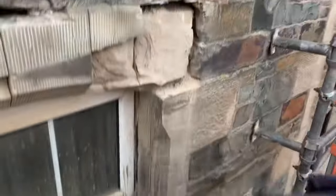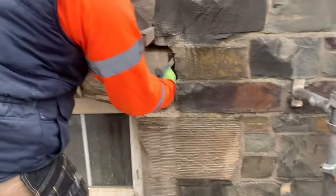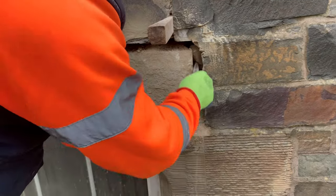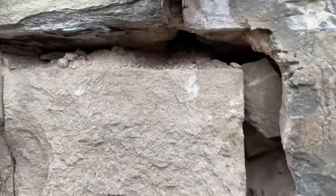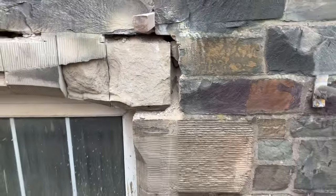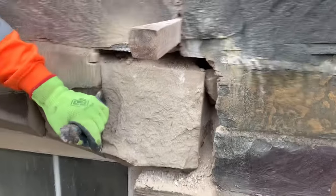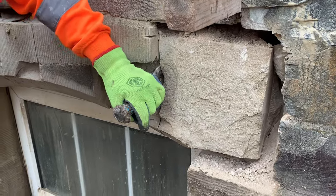This is the most important part - if you can take this corner of the lintel out without damaging the stone underneath, you're doing pretty well. This needs to be split in a way that allows plenty of operating room, so that when I put a bolster into these cuts, when a stone breaks it has somewhere to break into. Like I said, your stone has to have space to break into. Listen to the sound of the chisel as it splits properly.